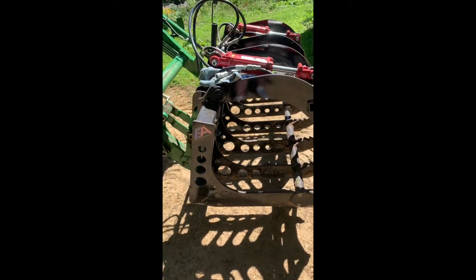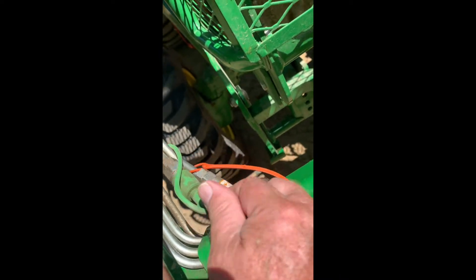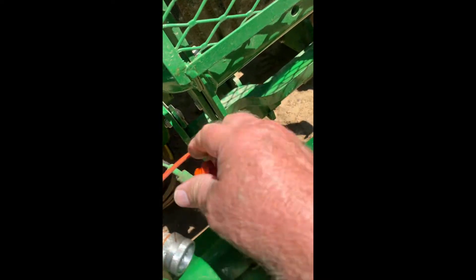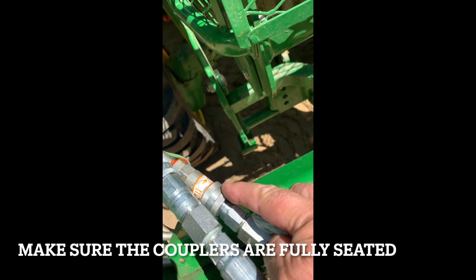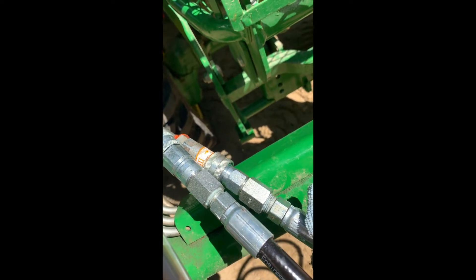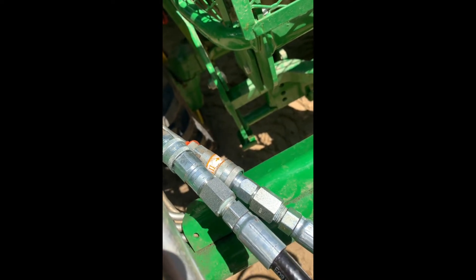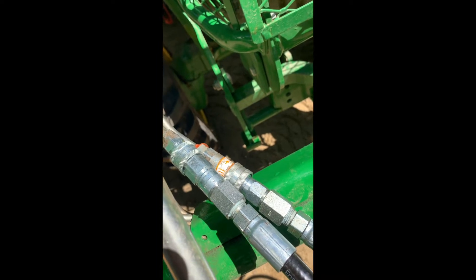We have the grapple hooked up to the tractor and the hydraulics connected. We have the two hoses with the male and female ends — this is the front hydraulics that we ran. My two connections come off and I'll hook the hoses up. You always want to make sure that these clamps have clicked and that they're properly seated. Whenever you're taking hydraulics apart, if there's pressure and you can't get something apart, you need to relieve that pressure — usually by turning the machine off and then actuating the hydraulic levers with nothing running. That will take the pressure off so you can disconnect the hoses safely.